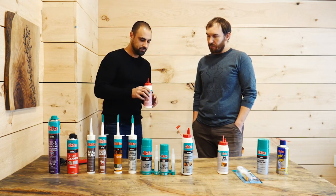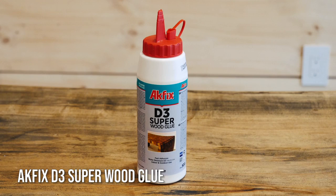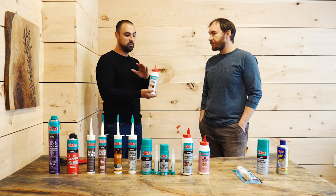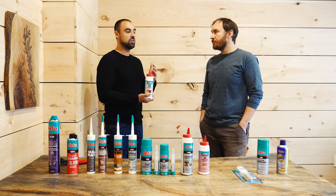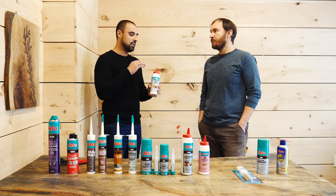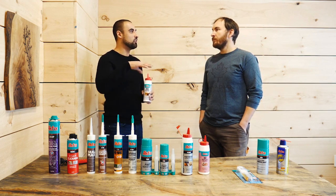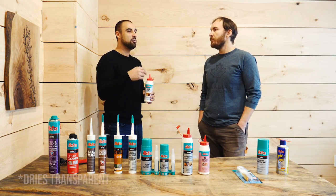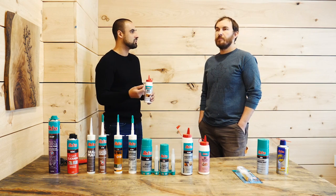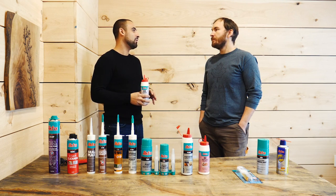That'll work. Right. The D3, the big buzz. Yeah, this is our main glue. So this is something, I mean, when I came to you, got you that sample, I know you love the product too, but a few of the things we've been told by a lot of the woodworkers out there, the trim workers, what everybody loves, it applies white, so you can see exactly where you've applied it in certain applications, but it'll dry clear. So it doesn't matter. Sometimes you'll get a glue that's like a cream color, and it shows when you put your final stain on or any final finish, right?